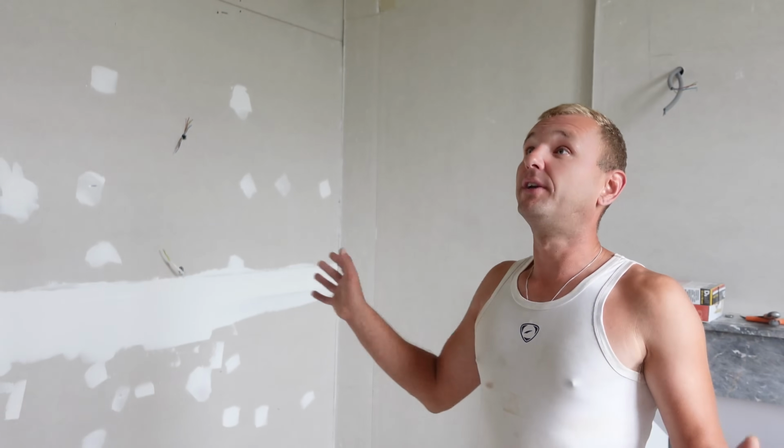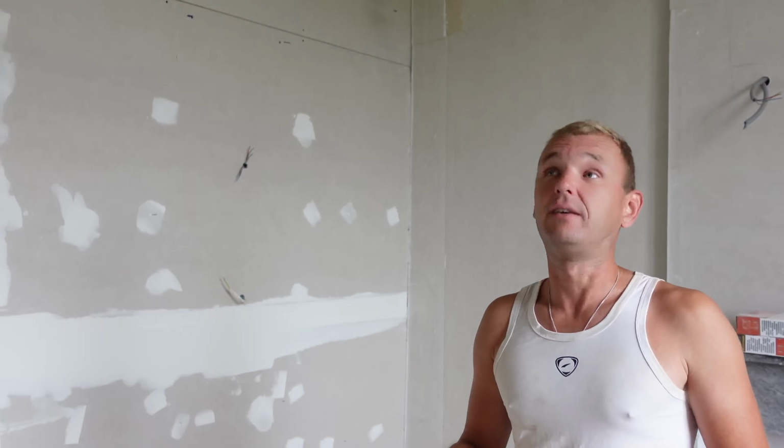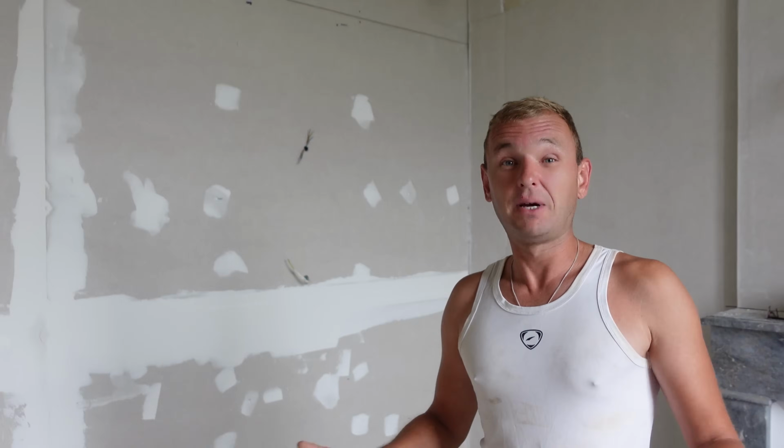And then my job in here, I started it yesterday, but it was a bit too warm and the plaster was going off straight away. It wasn't really usable, so it's cooler today. So I'm going to get all in here today, hopefully plastered, done, get all my corner joints done. I know someone had asked how we do them and what I'm going to do to finish the corners, so I'll show you that today if I can. And just start getting this to a point where we can get it sanded. I might even get some sanding done today and start making it look like a room again. These are the exciting times now, I've seen it all come together.